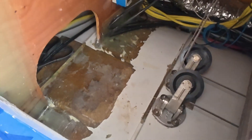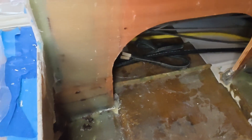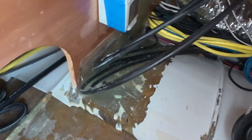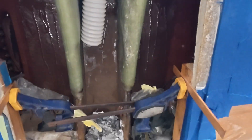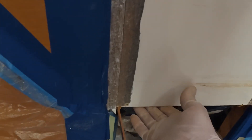Last view for this section. This is where the steering cables are — remember this one is not an F but an S. So we epoxied it all the way up, all the way over there, and then down — the load part, the section panel to the bottom. Now we're closing up. The pipe is in, it's all screwed in, epoxied. We're putting back this panel — it's more aesthetic than anything. Going to be just glassing the edges there.